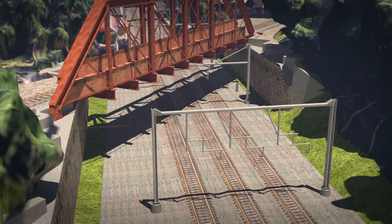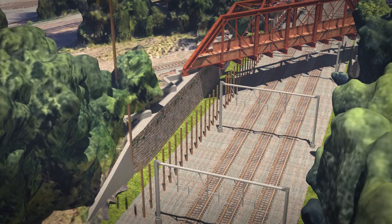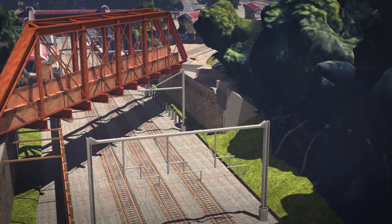To start phase three, on the east abutment soldier piles will be installed as a temporary support of excavation to allow for construction of the foundation. On the west abutment, a temporary vertical protection shield will be installed to protect the construction crew and permit uninterrupted work while constructing the west abutment.